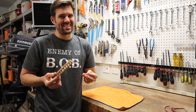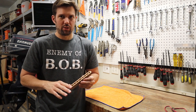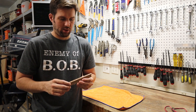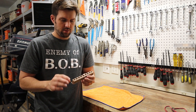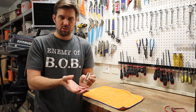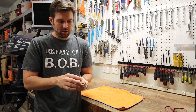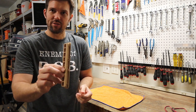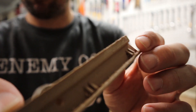The part isn't exactly clean and ready to go when it comes out of the printer, even if it's just regular plastic and not this wood material that I'm working with. There are some little stringy things that you need to clean off usually. And then also, since there are overhangs on this, there are some supports that were printed to support the overhangs as the piece is being made. So I'm going to remove those, clean up some of the stringy stuff, and then hopefully sand it down, stain it, and see if it works.